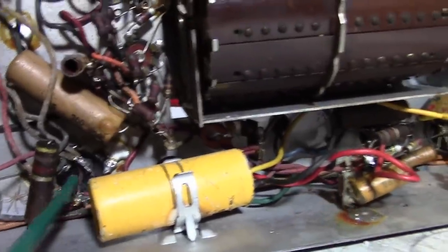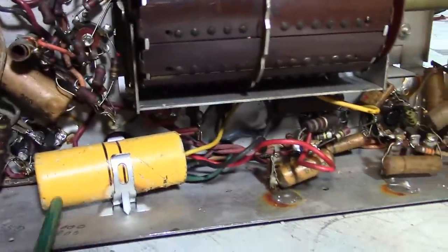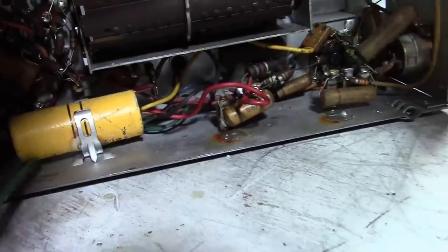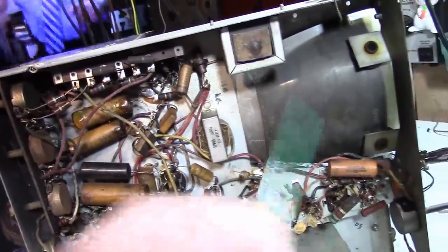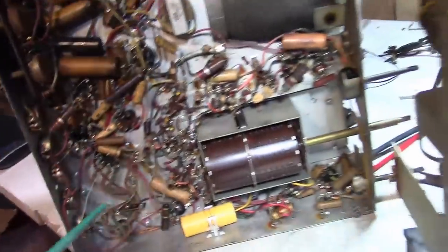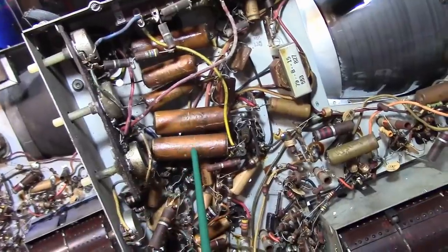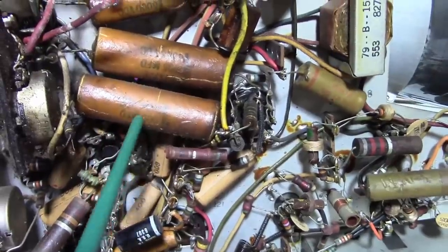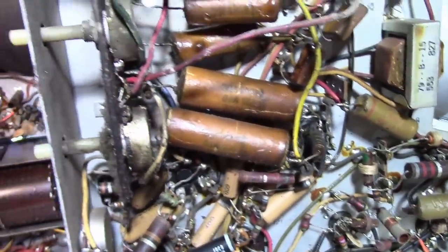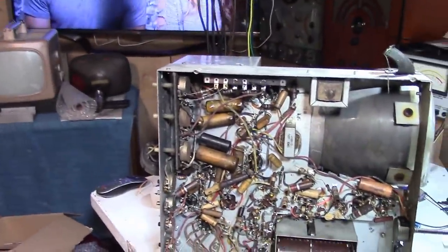There's where the original filter cap is coming through down below. And this is very likely the original three-section electrolytic, and that's a replacement. That is also a replacement, but I think everything else in this one is original. And these look to all be the original. These are the high voltage capacitors. These are 6,000 volt caps, oil impregnated. That's why they look oily. They soak the paper in these in oil to increase the electrical resistance. Usually bad, but let's give them a shot anyways.